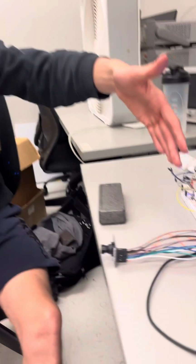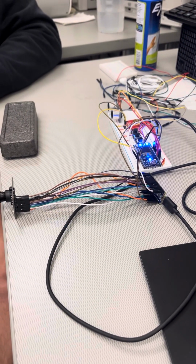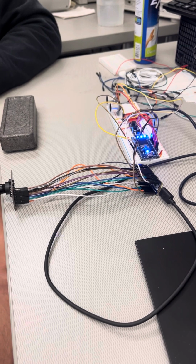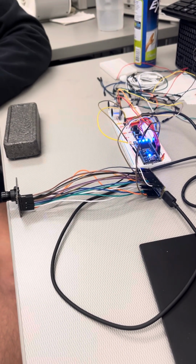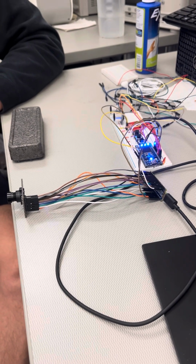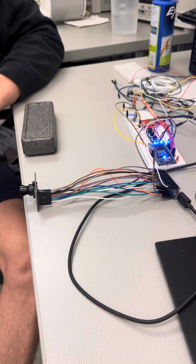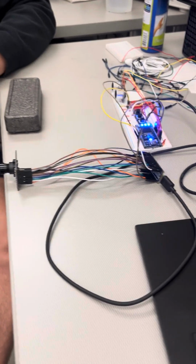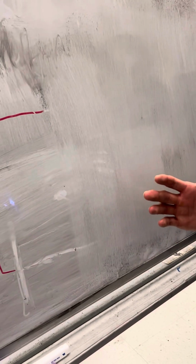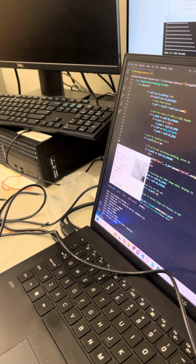So we have two MCUs. First, we have the Arduino Nano BLE33, and that is specifically only for doing the machine learning and object detection. We have connected it to the OV7670, and now we have the camera working. You can see in the image the trace of the camera. In the background you see the background picture, but if I put my hand there, we can see my hand shows up in the picture, and it's trying to do some sort of prediction.